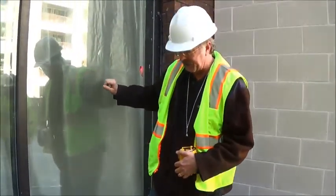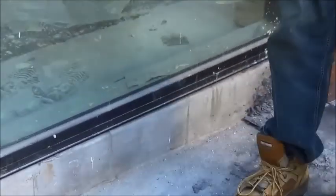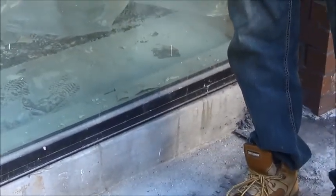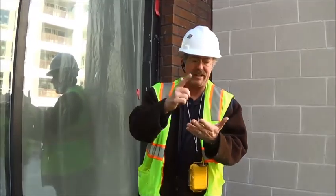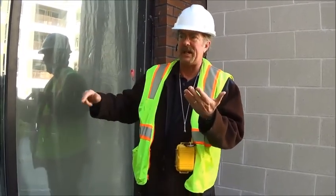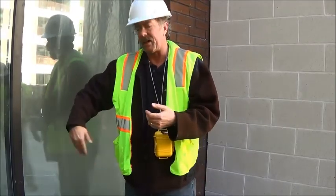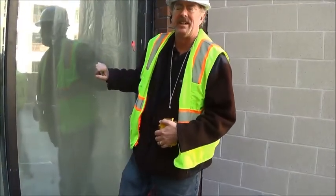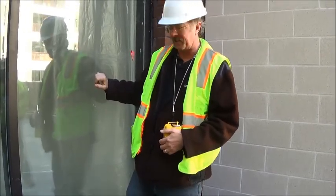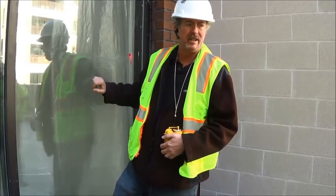A lot of times I would always suggest that before the window's placed in there, you place a peel and stick type of adhesive back air barrier, leave the paper on it, just take a knife and thinly slice the paper on the back, so you've got about 1 to 1.5 inches exposed. Peel it off, prime it all up, and it tucks just under this cap. It saves you in the future, because if you ever mess up on your upturn, you've got this membrane to cover you.